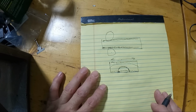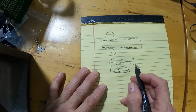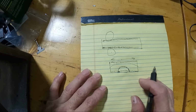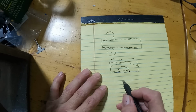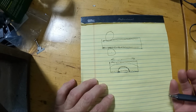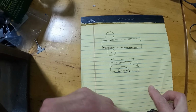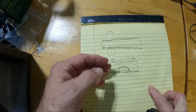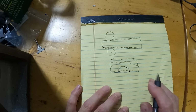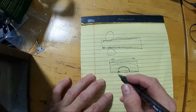Now that's one way to put stress into the material when it's manufactured, and the other way is you can actually put stress into the material when you're machining it, which any machining operation does to some degree. But depending on the cutting tools you're using, some can put more force than others. Like a bigger face mill facing across a piece of stock will tend to put more. It pushes more material back into the part than, say, a smaller diameter end mill that cuts a little cleaner. And the more negative rake tools will do that too. They push material into the stock.